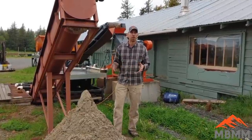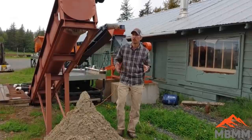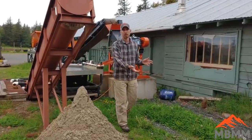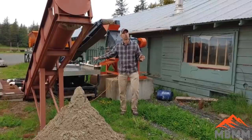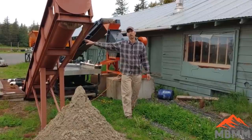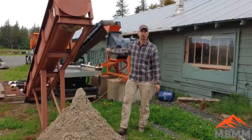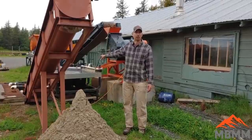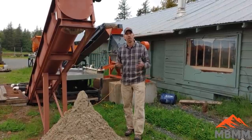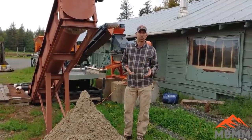You can purchase a ball mill, you can leave the entire system the way it is, and actually if it were me and I was going to implement a ball mill into this system, I'd take our spiral classifier, I'd put a ball mill right here, I'd divert the spiral classifier right into the ball mill, I'd increase the table to a 2 ton per hour table, and I'd run the ball mill directly onto the table with the head ore. So anything that goes out of the spiral classifier into the tailings is true tailings. Anything that gets augered up goes through the ball mill and is reground and put right back directly onto the same production table that the head ore is running. And so all the values are going to end up going over in the number 1 or number 2. So that's one way that you can increase your production or increase your recovery by adding a regrinding circuit to your production.